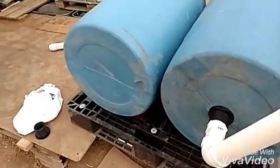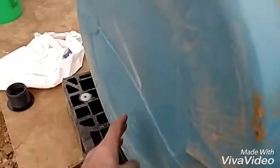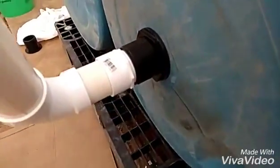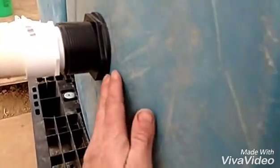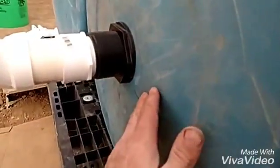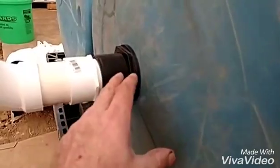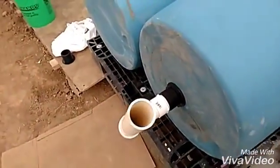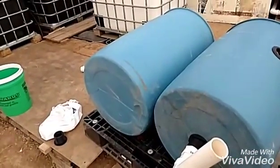Here's what the bottoms look like. You can see how they normally are shaped — they usually go up, so this part's sticking up. This one I've heated up and forced that down so it's got convex in there a little bit better. This next one I'm going to try to make even a little bit more pronounced. That should help the solids come out a little better. Let me take that barrel over there and I'll get started and show you how I did that.